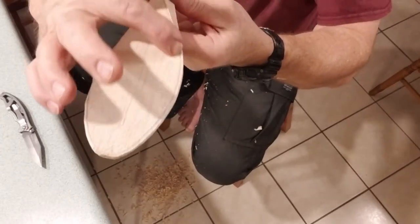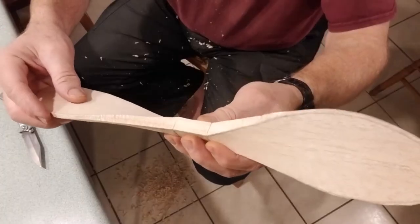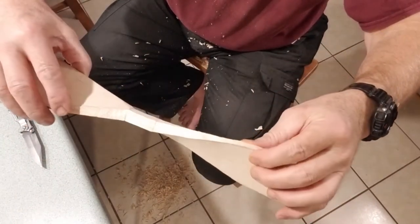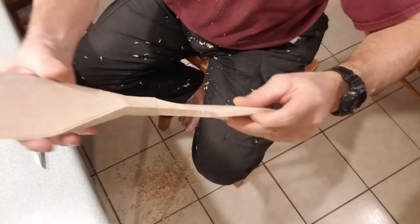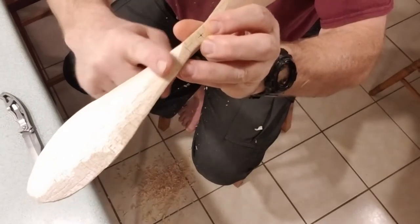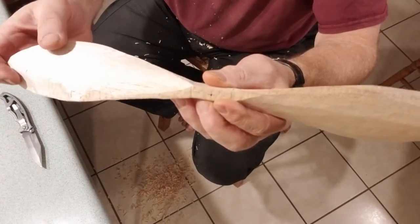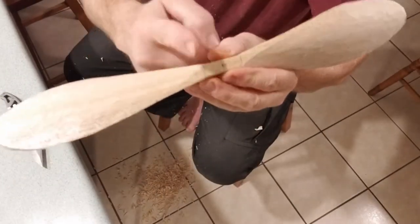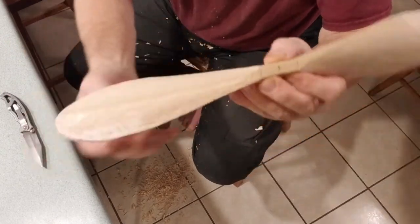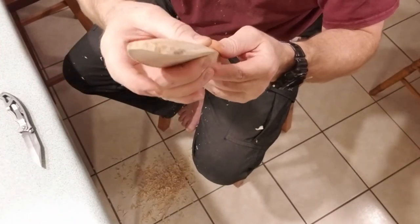I've gotten closer to the line on the profile. I am getting these shapes showing up in the carving. Here is the transition, the radius on the front side. Both blades going down to the high point. So this is the high point of the airfoil following the pitch.